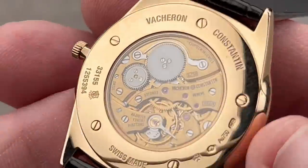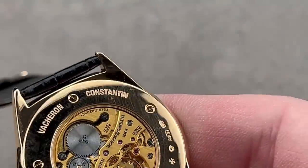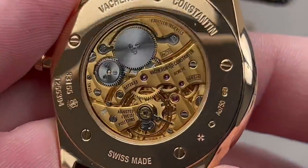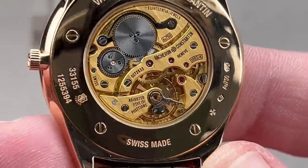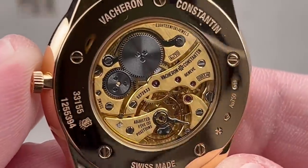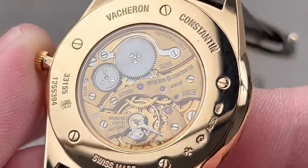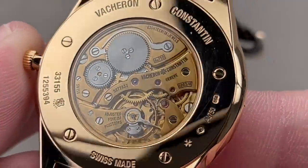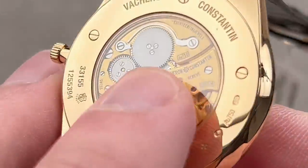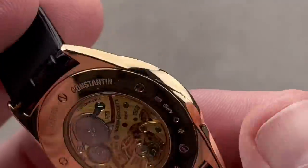Flip it over and you can see the modern-day descendant of caliber 1003 — this is the 1003-4, with some upgrades. First and foremost, the movement is now made of solid 18-karat gold. Just like F.P. Journe, the movement is solid gold; unlike F.P. Journe, the movement is also Geneva Hallmark. Ultra-thin at 1.64 millimeters thick, this movement is intricately finished and immaculately decorated, yet still five-position adjusted. Look at the solarization, the stripes, the mirrored beveling, the inward and outward angles, the engine turning, the black polish on the extended regulator index and the Geneva-style stud holder, the solarization on the ratchet wheel and crown wheel core, the black polish of the click and click spring. This is as good as it gets.